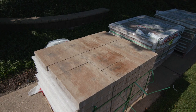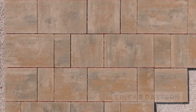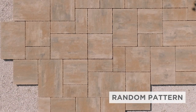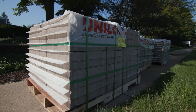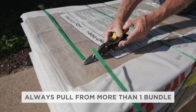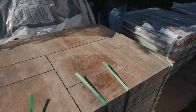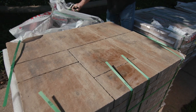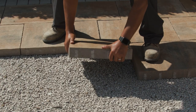Bristol Valley is sold in a three-piece random bundle that can be installed in a variety of patterns, from linear to random. No matter which configuration you choose, always remember to pull from more than one bundle at a time — at least two, and ideally three. This ensures that any slight color variation between bundles will be evenly distributed in the finished project.